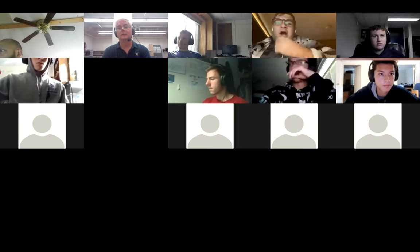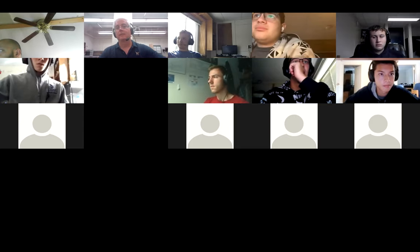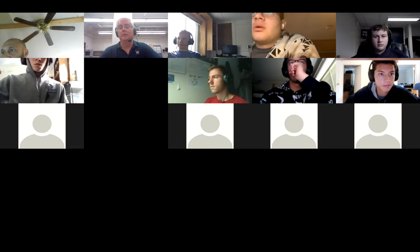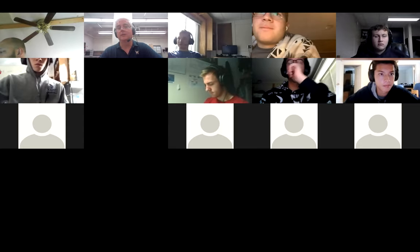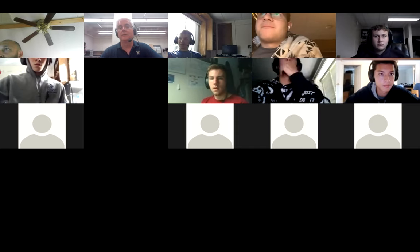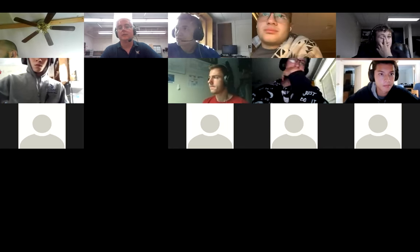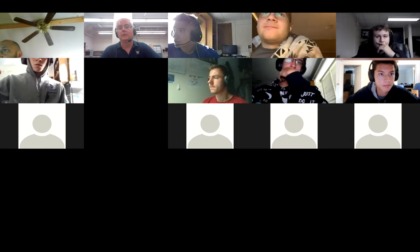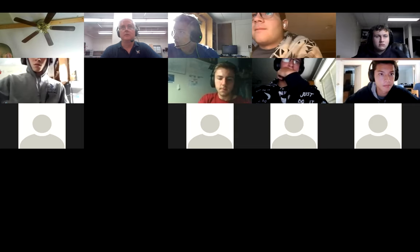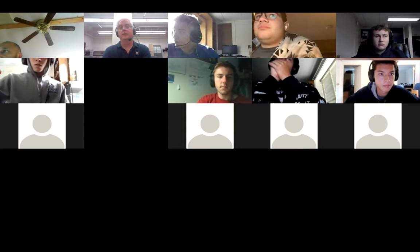I can't even see inside the cup to even look at that. You can't rotate around so that you get a view at like... Okay. I get the face, actually. Is there a way to do like an internal fillet feature? Yeah, it should decide on its own. Base. Okay. Here, one sec. Fillet feature... Base. Smooth edges cannot be filleted. That's probably because you already have a fillet on the top edge. So it would want to lay a fillet on top of a fillet, and they would conflict with each other.